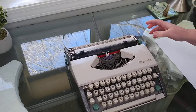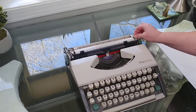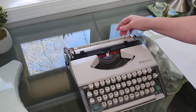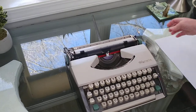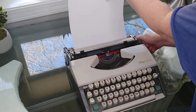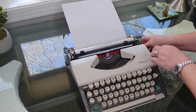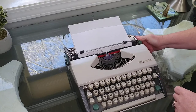This is a little bit different than Smith Corona. On Smith Corona, the very back lever is the carriage release and the front lever is the paper release — it's reversed on the Olympia Traveler. So this lever is going to release the tension on the paper in case you need to adjust it, and the front one releases the carriage. Let's go ahead and roll that in. Also, if the roller doesn't catch the paper, check to make sure that your paper release hasn't been flipped up, because if it has, the paper's not going to roll through. We'll roll that through and it came through pretty even.